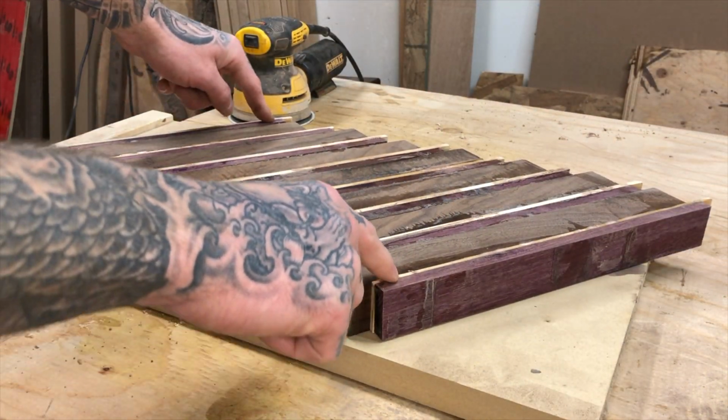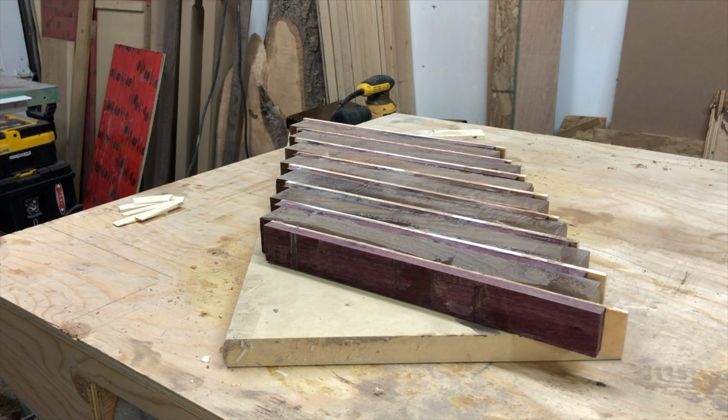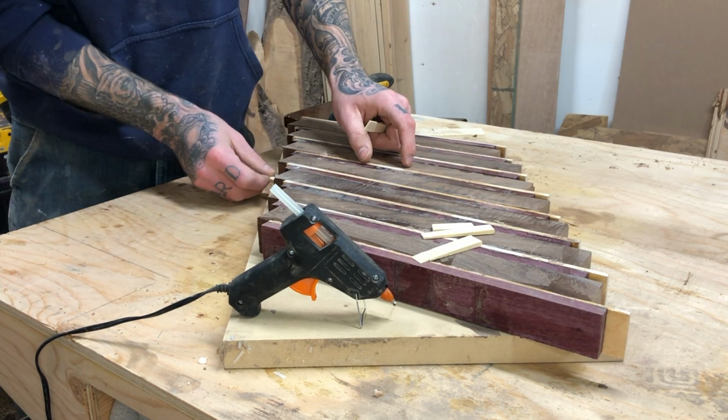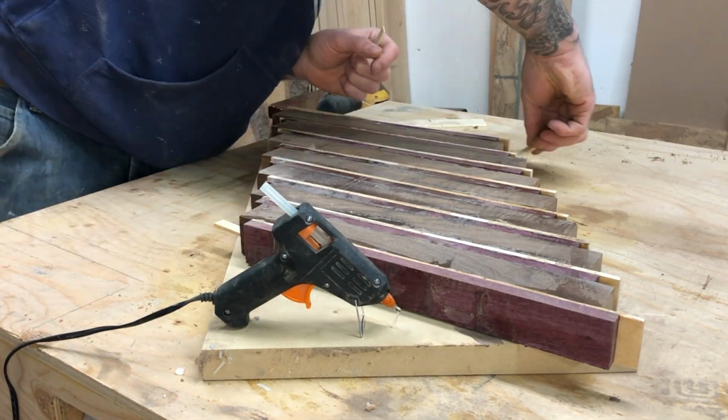And as you can see, I didn't do the best job keeping the strips flush, so I had a bit of wobble. Not to worry though, this is an easy fix. I grab my planer sled and start putting little wedges under any high spots to prevent the wobble as it moves through my planer.